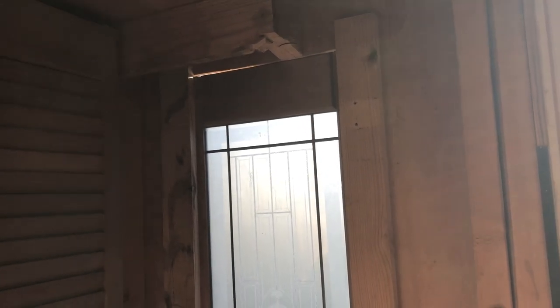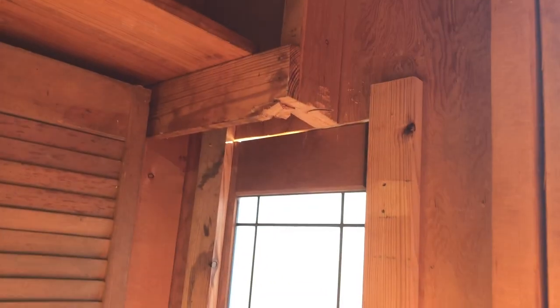You can see I just kind of chunked this away right there. This is a shed — it is not a residential building, it's nothing that anybody's going to live in, so you can get away with some pretty rough work. There are no codes that need to be followed for a shed build, so even though that looks a bit rough on the inside, it's okay — it's not hurting anything and structurally it's fine. That extra 2x4 down the middle was literally just extra, because that span is not so dramatic that the building will be structurally unsound with that cut. I wanted to point that out because I know some people might say, 'Oh no, you cut a board.'